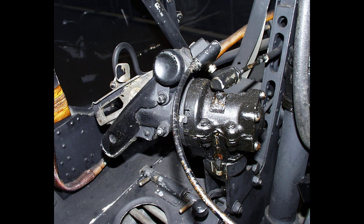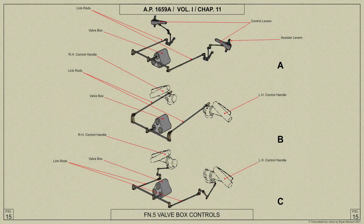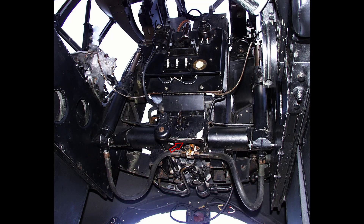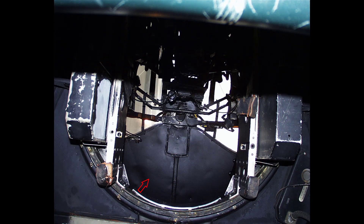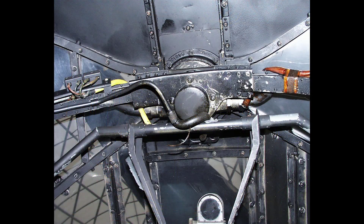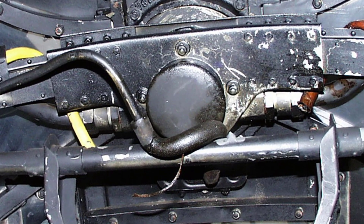The two control handles are mounted in front of the air gunner on the caudal stiffeners and are connected through a system of levers and linkage to the valve box, which is attached to the torque bracket situated underneath the gun cradles. The rotating service joint is supported at the top of the turret in the center of the arch frame and is connected to the valve box by the main pressure and exhaust oil pipes incorporated in the arch frame.